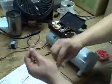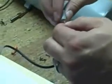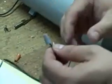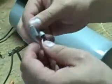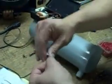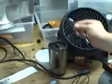All right, so we're going to take our cord here, and again we'll go brown to red with a gray wire nut. Now the reason I suggest using gray wire nuts for this, these ones in particular, is because we're only doing two wires, not four or five, and it's super small gauge, and that's what these wire nuts are really meant for. And ultimately we're going to be shrink wrapping this wire too, which I'll do in a second here. But we're going to take these wire nuts, line them up like so, and wrap them in a shrink tube that we're going to run over the top of this wire.